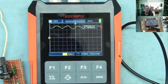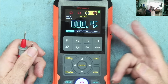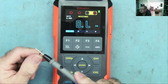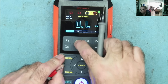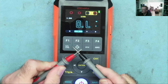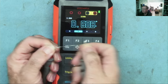Let's have a play with the multimeter features. One of the first things I always test is the diode and continuity mode. We're on resistance range at the moment on auto-ranging, so it takes a few seconds to settle — that's quite normal. In diode mode: shorting the leads goes to zero, as expected. A normal silicon rectifier diode reads 0.6 V and doesn't bleep.